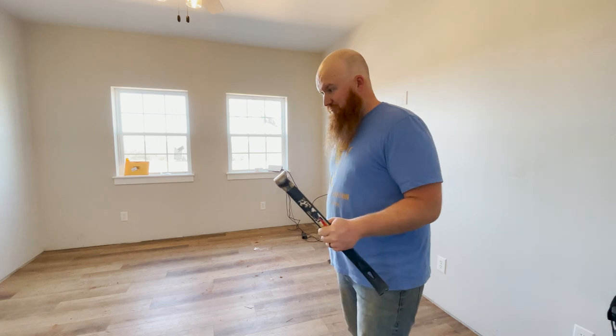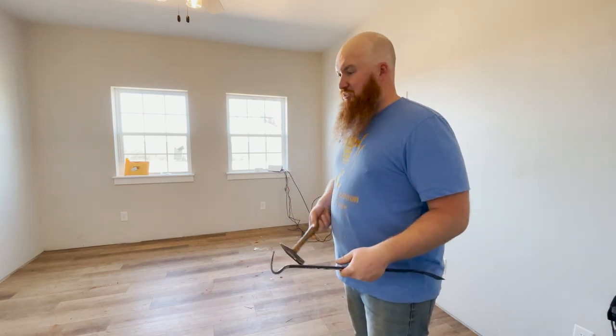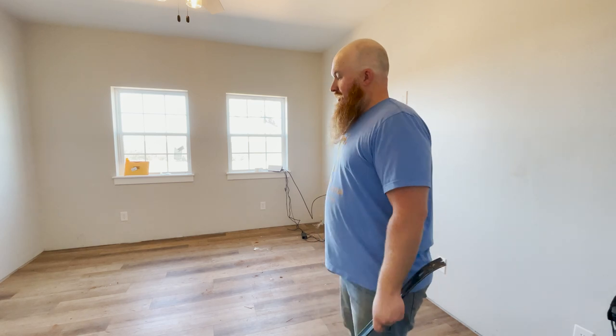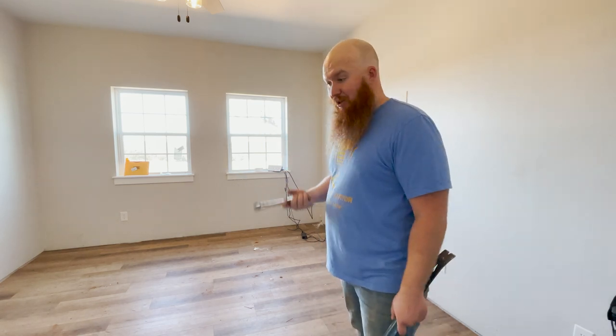Also, when in doubt, if you have a spot with a nail — because usually what happens is some nails will go with the baseboard, some nails will stay in the wall, they'll pull through the wood because the wood just lets go, especially if you're using a pine or a cedar. The majority of your nails, if you actually hit them into studs, they're going to stay in the studs and just pull through the wood. When in doubt, it's easy to just hammer the nail in — knock it in.